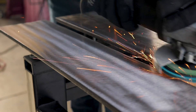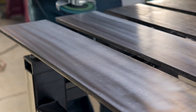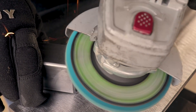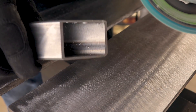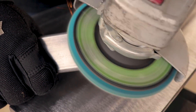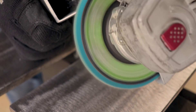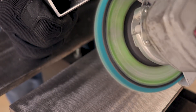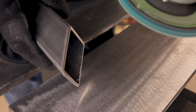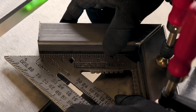I like to do this after I've been welding on my table. After I've cut the 45s, I'll go around and grind down the edges until I have it about halfway on the sides. Then on the back side where it's going to be an open corner, I'll grind that almost all the way down — like where it's pretty much flat. The fillet I leave alone; I'll just deburr it because a fillet is generally strong enough for me as is.